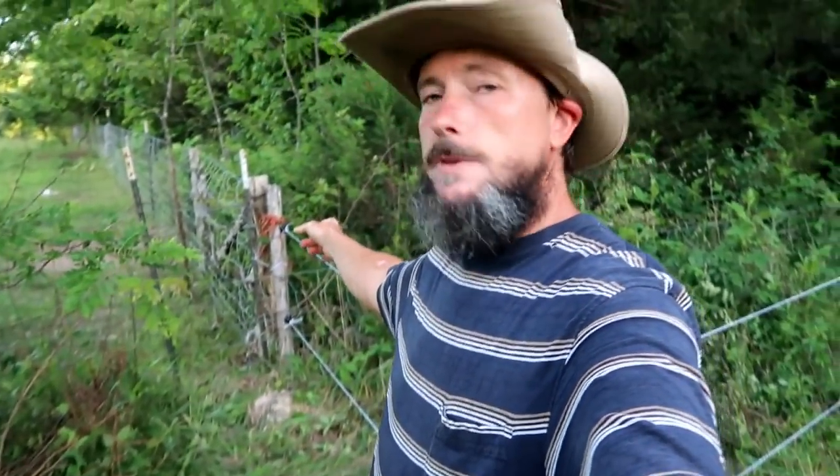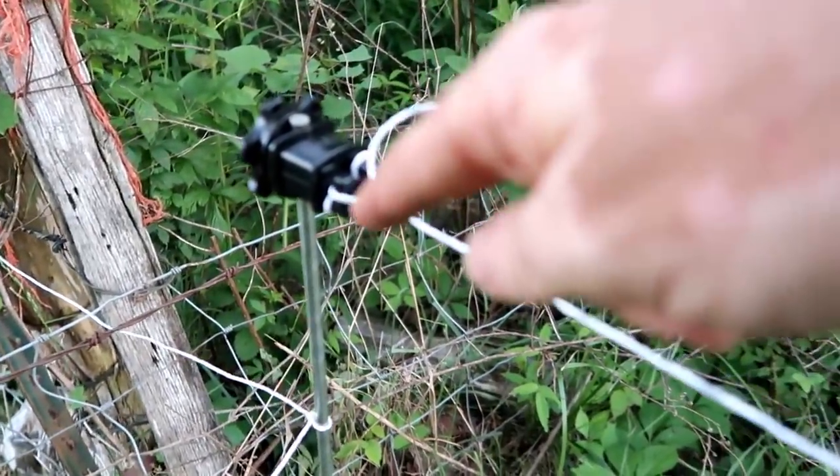For those of you like me who have very little experience with electric fencing — I've worked at places where they had it, but I have no experience actually setting it up. I've helped with maintenance when it was already set up. Wherever you hear that ticking noise, the fence is actually grounding somewhere you don't want. That takes power from the electric fencing and makes it weaker in other spots. I heard that ticking noise right over here, so I knew to look for it.